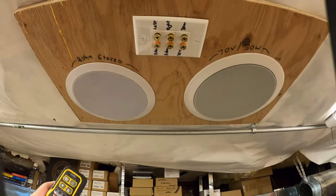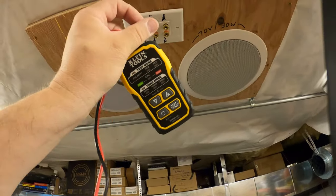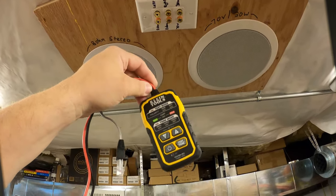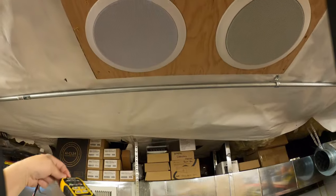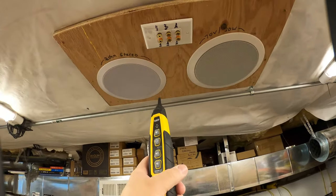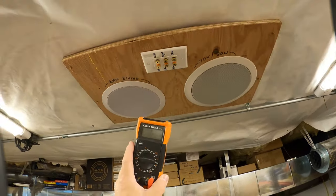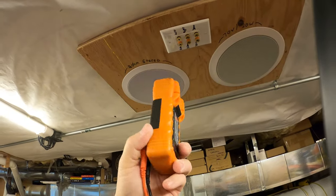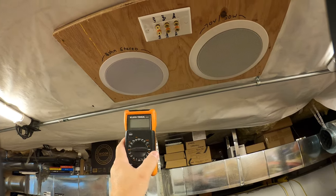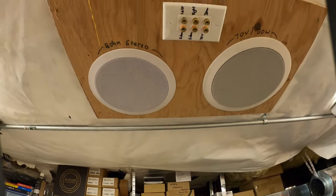What you're going to need is a basic tone tracer — something from Klein. This is just a basic Klein one, about $50 or $60 on Amazon. I'll share a link to the one we use. It does come with a probe if you want to check and trace wires. You're definitely also going to want a multimeter — this is just a basic Klein that goes in our travel bag. You'll set that at 200 ohms and that'll give you the reading of the speakers.